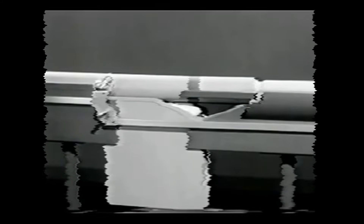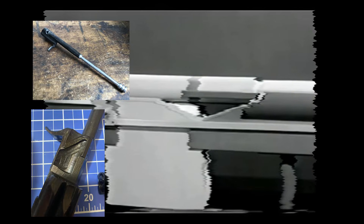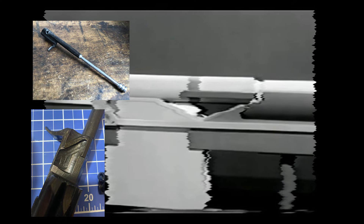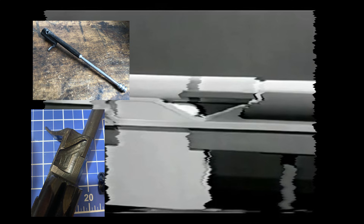This video is from the United States, and the example being used is the M1 Garand, although practically all firearms with a rotating bolt work from the same principles. In the case of the Garand, the cam track that mechanically forces the rotation of the bolt when it is displaced is fixed to the gas piston or operating rod. This is what is known as a long-stroke gas piston system, where the piston or operating rod is joined to the bolt group and accompanies it the entire travel. A similar example would be the AK-47. In fact, the AK-47 system was inspired by the M1 Garand, not the STG-44, as many people think.